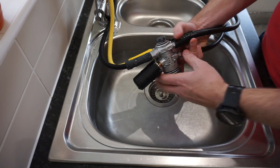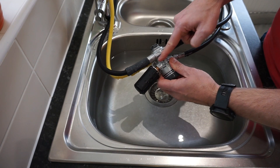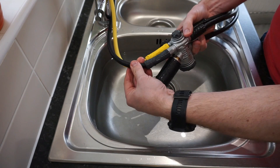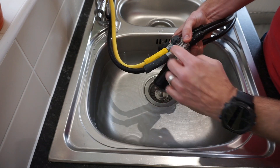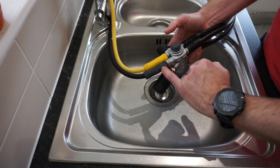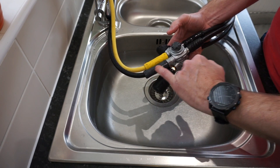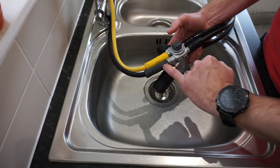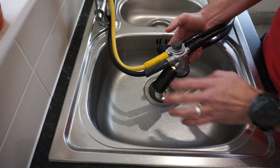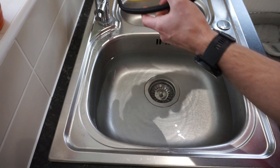Things of note: if you've got a turret like this one, make sure you get plenty of fresh water into there. And also, if any of your hoses have a swivel at the top, make sure you give that a good rinse. The other thing you want to do is make sure that you pull these back and give it a good rinse underneath, because salt water and salt particles love to live under there, and that will corrode where the hose is going. So if you can give all that a good clean, you'll be sorted.